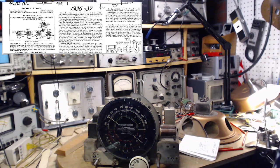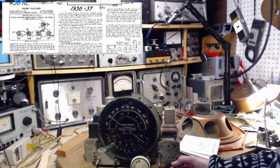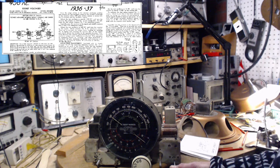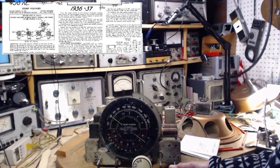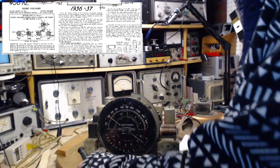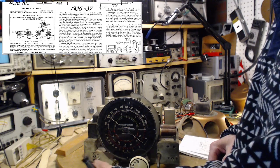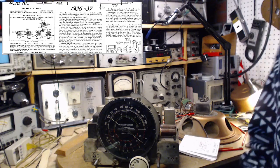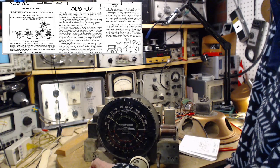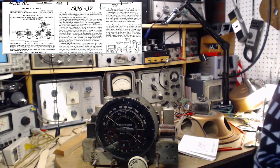This is, well, looks like a capacitor. Maybe it's in series or something. Here we go. Watch the meter. Down. All the other way. Ever so slightly off. Not much at all. There we go. Okay, let me just turn this down a bit. Sounds like a dirty volume control that's going partly open there. Something's happening. We'll ignore it. Adjust trimmer 8. Here we are.